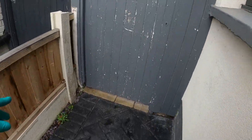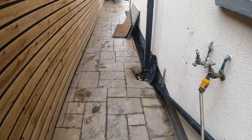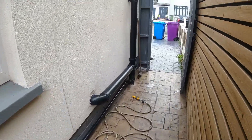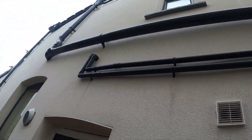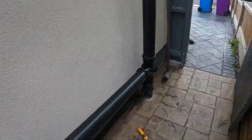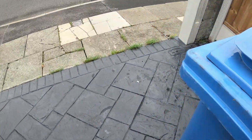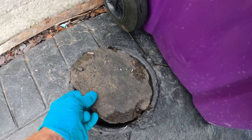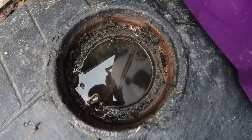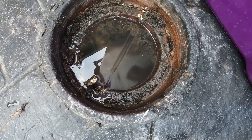As you go through here, she's got a tap there, a kitchen gully - these aren't affected because the lowest point is the interceptor, so those pipes work. Wow, that's a long run. You've got one, two - toilets, toilets - so you've got three toilets by the look of it. The main issue is the interceptor. Let's flip this up - they've got a piece of slate on it. There's maggots in it - yeah, maggots!